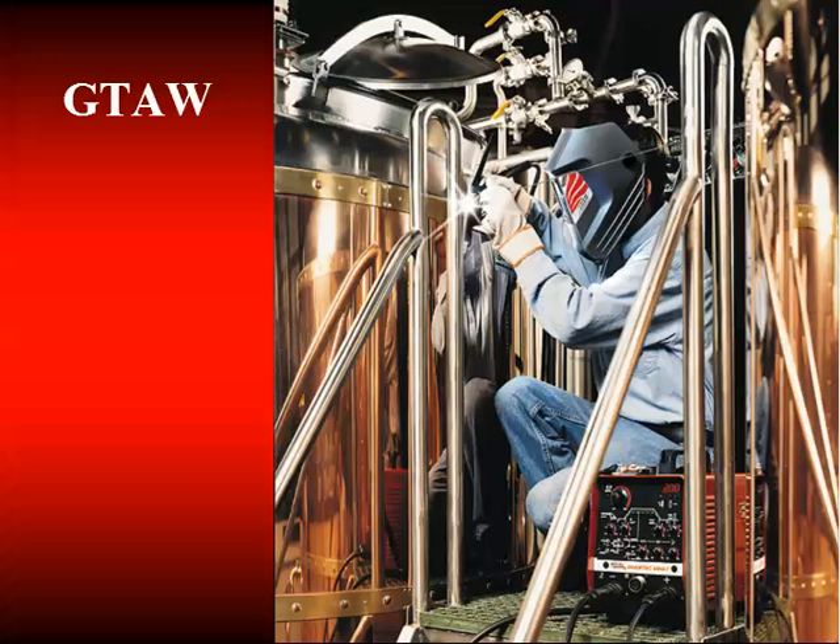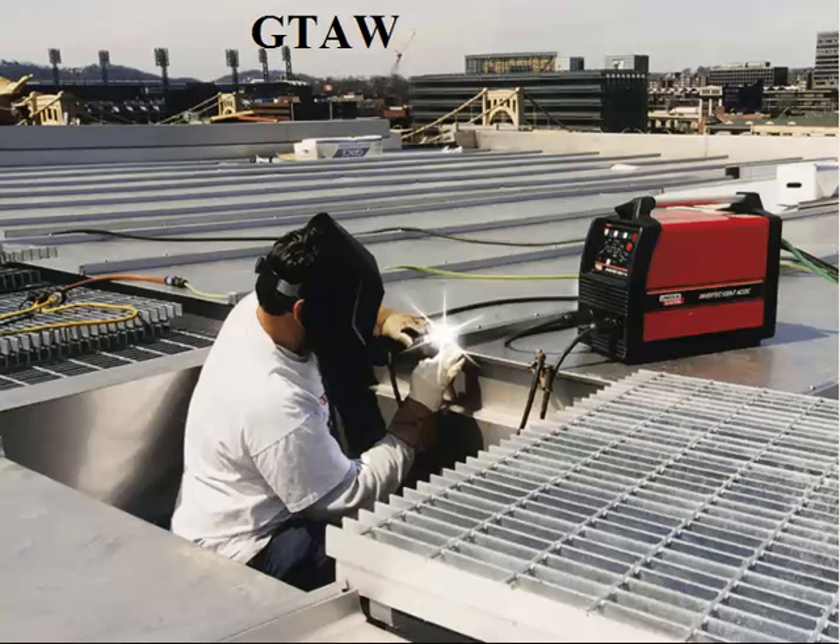For the convention center in Pittsburgh, there is a stainless steel roof that was welded in place with gas tungsten arc welding. This also shows one of the latest developments in power supplies — inverter-based machines. The old rule of thumb was you needed 100 pounds of steel for every 100 amps out of a welding machine, so a 500-amp machine weighed 500 pounds. Inverters have condensed that down; now we get maybe 10 amps per pound, making it very portable and electrically efficient.